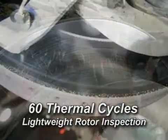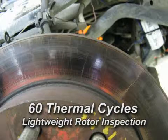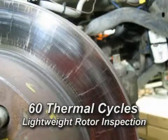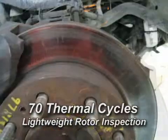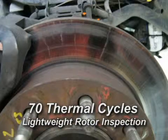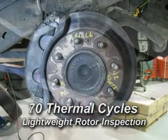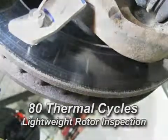Additionally, the lightweight rotors tested on the vehicle were an average of 21.3 pounds versus the original equipment rotors at 25.5 pounds — 4.1 pounds lighter than the OE rotors. On April 27, 2010, Link Vehicle Testing informed Affinia via a letter that they had completed 100 thermal cycles of the SAE procedure. Currently, the front rotors, especially the right front, have several significant cracks. Given the type of vehicle being tested, the current condition of the rotors, and the track design, we have suspended the test due to safety concerns.